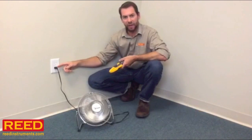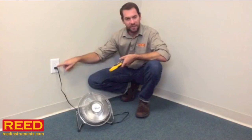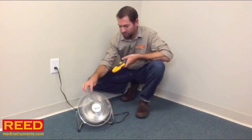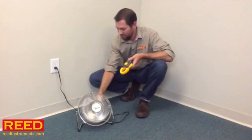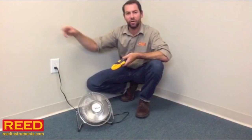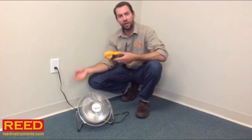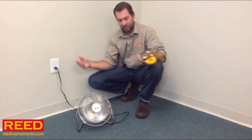What's going on is the way power works. You have a hot side and a cold side — positive and a negative. So power is coming in, going through the fan, making the fan turn, and going back out into the wall. So what's happening is you're getting one reading going up, one reading going down. They're canceling out and giving you a zero reading.